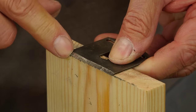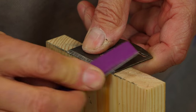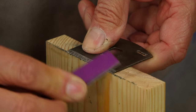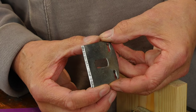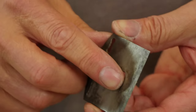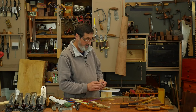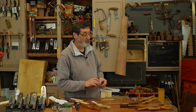This is going to simplify your edge-tool sharpening for the spokeshave. On this coarse level I'm getting the whole of the back bevel and taking out the rough marks left by the original manufacturer's grinding. I could also use that coarser sandpaper. Now I just go with the different grits — I've got exactly the same result, with a burr on this side. This is ready for polishing out. This works for all of your spokeshave sharpening — it works perfectly.